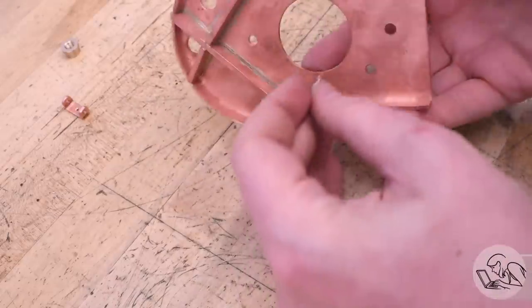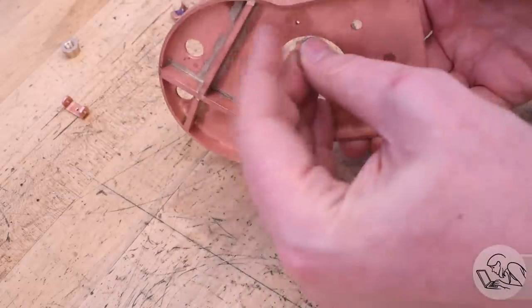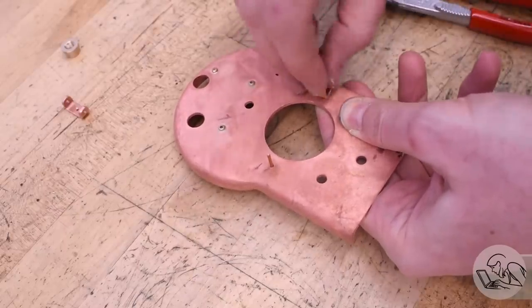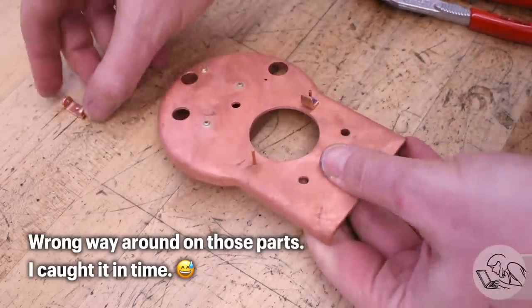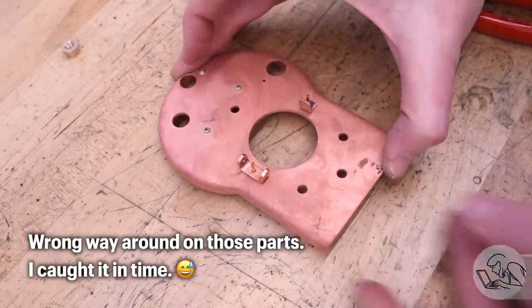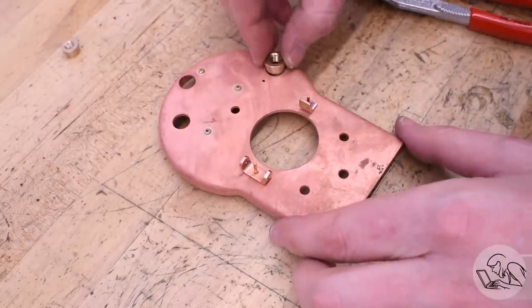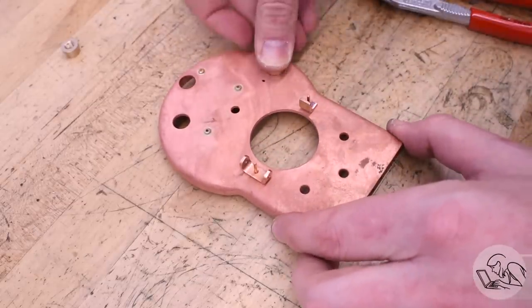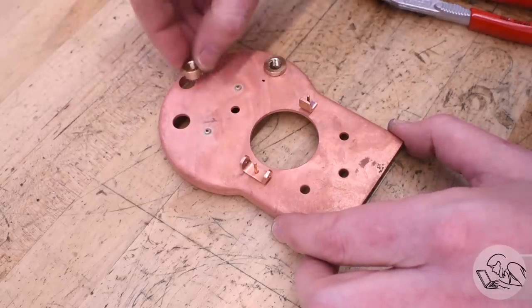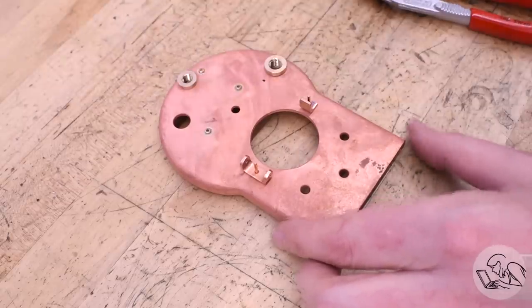These little hinge parts are another hybrid of rivets and silver solder, so more messy fluxed riveting. If you're wondering why some parts are riveted, it's because silver solder is very strong in shear, but not as strong in tension. So it's good practice for any part like these where the pressure is behind them and tending to push them away from the joint to rivet those to give them mechanical strength in tension. So you're not just relying on the silver solder for that.